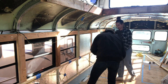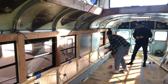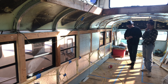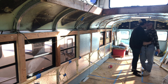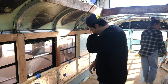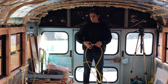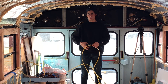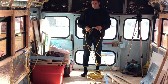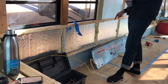What's really important for off-grid electricity in your bus is the amount of amp hours in your batteries. You could have 2,000 watts of solar panels on your roof, but if you only have 500 amp hours of battery capacity, you're only going to be capable of using 500 amp hours of electricity. Outlet one, outlet two, outlet three — that's all we want on there, unless we wanted to run an external outlet. We'll leave some slack so we can run an outlet underneath into our storage box.